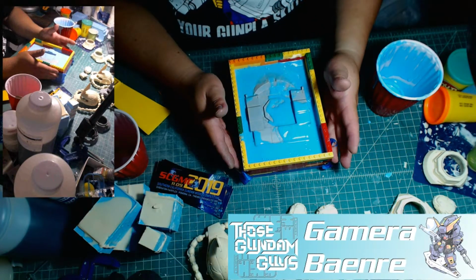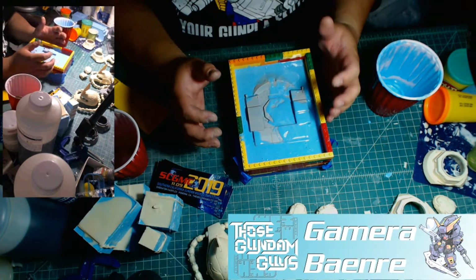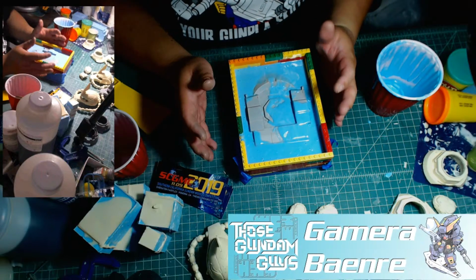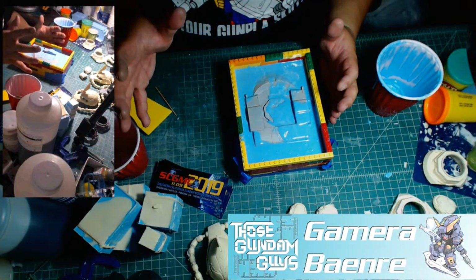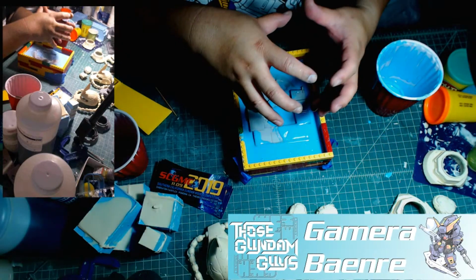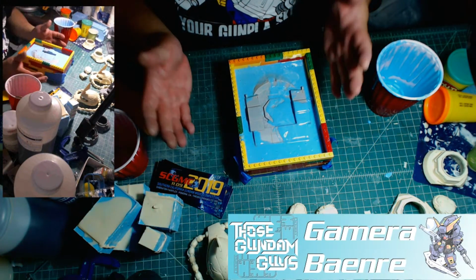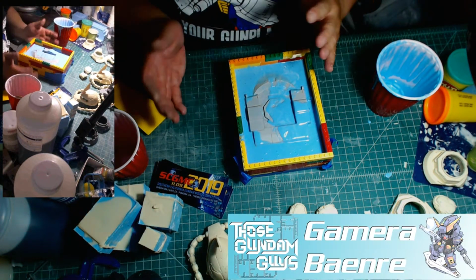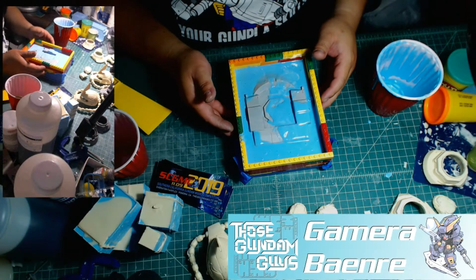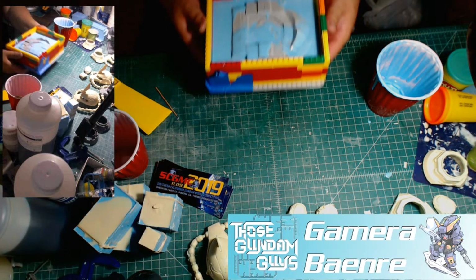The other option would be to do a vacuum chamber, which sucks the silicone out. But the way that works is you'll suck the air out and then you release it so that it compresses. Otherwise, this becomes this big expanded piece of silicone. So it's easier for me to use a pressure pot. So hopefully this will fit in my pressure pot. That's also an interesting thing that I haven't actually validated.